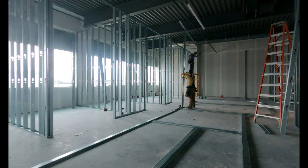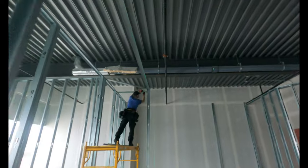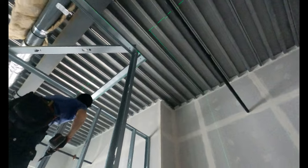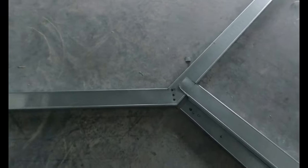Sometimes you want to check when it's coming off the wall because the walls can be leaning in or out. If it's leaning in a little bit it's okay — you can bring your track out off the wall a little bit. If it's leaning out, you simply trim the end. Get all your track prepared from the bottom like this after the layout. You're always planning tabs — they're overlapping so you can screw it all together and it'll help brace itself. The one going straight across is going to be a header because there's a door going in here.